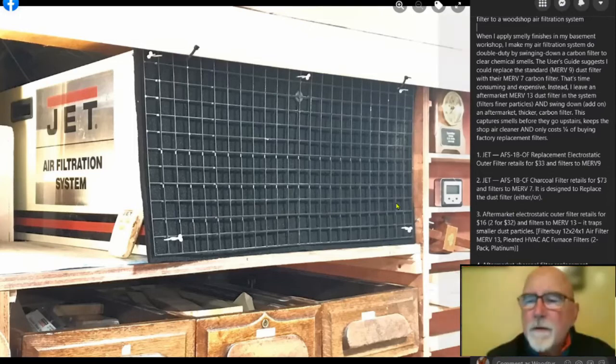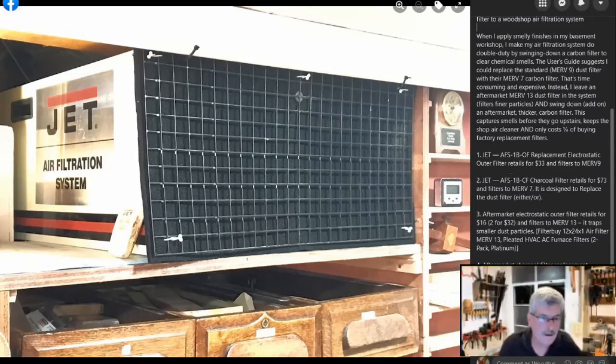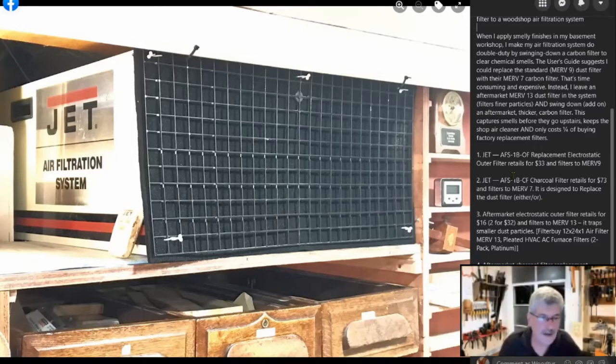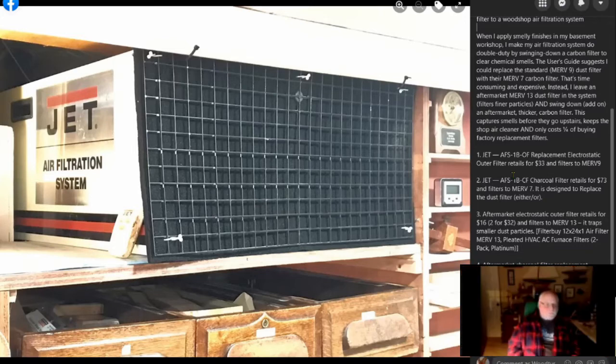Yeah, I like it, Greg, because I've got a similar air scrubber like you have, and mine doesn't have an actual replaceable filter. It's got one of those cloth things that you take outside and pound and use an air compressor on or whatever. So to cut that down, my form factor is 1 foot by 2 foot, so I go to the hardware store and buy 2 or 3 regular house filters and put them in front of that so I can throw them away without changing out my big filter. Okay, good. And I didn't mention that inside this box, there's not much more to the jet filter than a box and a fan. There is another filter, which is cloth, like you mentioned, and Jet would like to sell me a replacement for that, but I don't think I'll ever replace that. I just take the other 2 filters off and put my shop vac back in there and dust it off, and we're good to go.